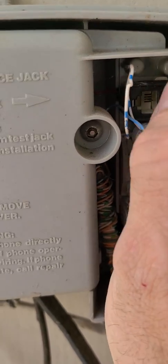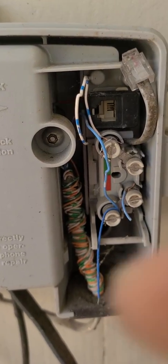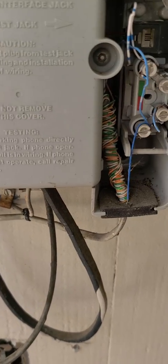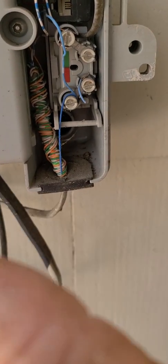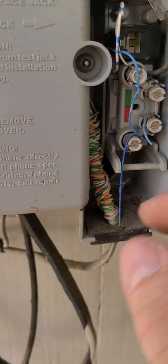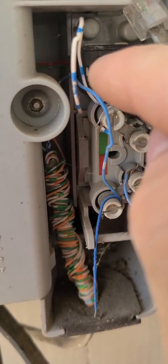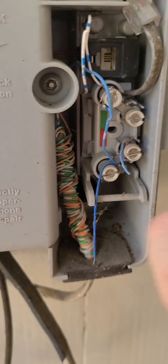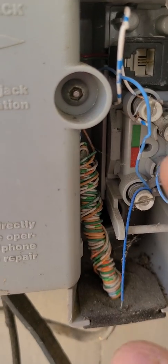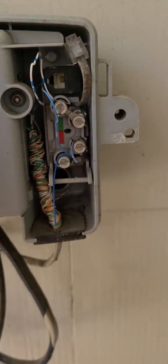By unplugging this, we'll tuck it in right there where it was. What that does is allow the phone inside the room where the Xfinity phone is hooked in to backfeed. It's backfeeding into these different wires right here, which backfeed into your house and allow you to activate your jacks. So it's simple. All you do is come out here, open this box up, and unplug this one right here, because if this is plugged in, then it bypasses ours and makes all your jacks work off the main phone company out at the pole. So unplug this and it activates all these with our system, because it just backfeeds into it, and then it's a complete circuit. So we're going to close this back up.